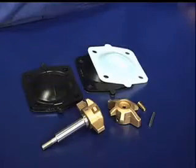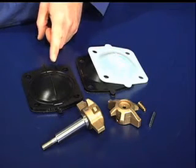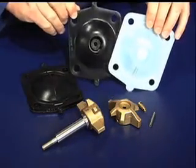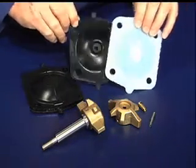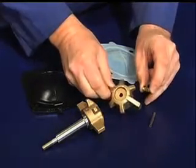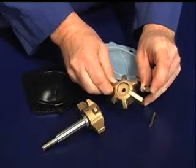Identify if the application uses a two-piece PTFE diaphragm or a one-piece elastomer diaphragm. The two-piece diaphragm consists of a PTFE diaphragm and an elastomer backing cushion. This two-piece PTFE diaphragm connects to the compressor via a floating tube nut. An elastomer diaphragm for this series threads directly to the compressor.